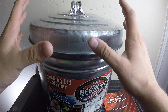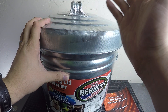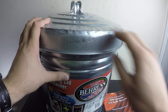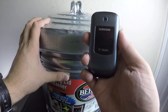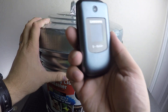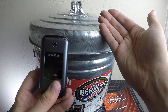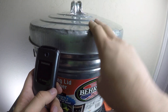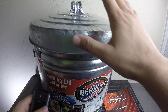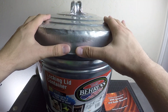One thing I like to think of with a Faraday cage is that this isn't a wall that blocks all of the radio frequencies. What this is, is more like earplugs. When you go and shoot your firearm, you put earplugs in your ears and you can still hear — you can still hear guns going off — but it doesn't damage your ears anymore. That's what this Faraday cage is going to do. This cell phone is made to use tiny amounts of power, tiny amounts of wattage, and still be able to make a phone call. Same thing with a ham radio or a walkie-talkie — if you put one in here, you're still going to be able to hear the transmission coming out.